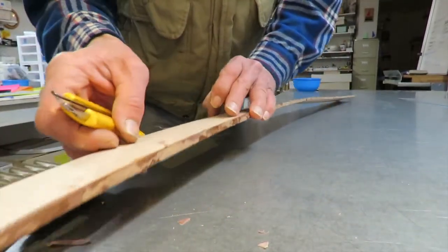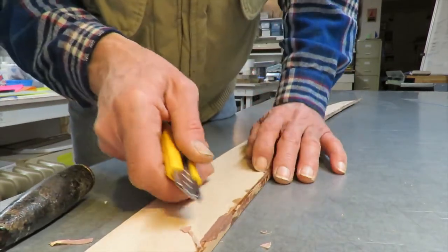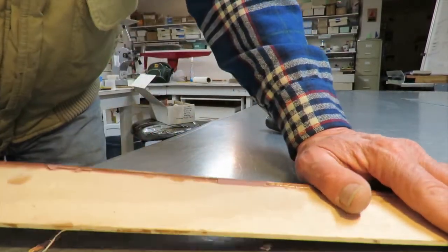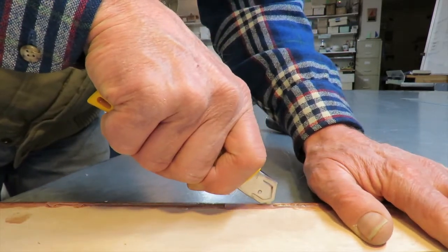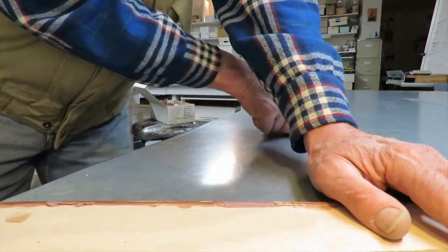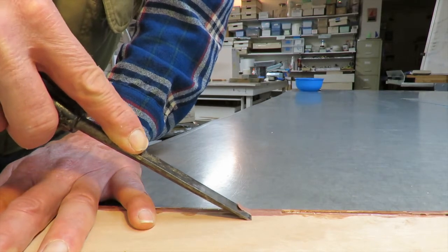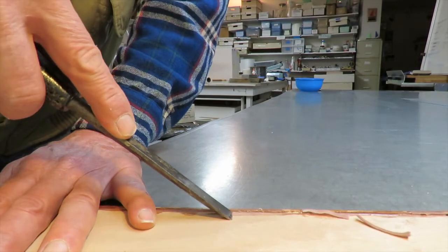Here's a real classic one. Cut right along the edge of the wood, trying to cut just down to the plywood but not deeper. Now moving my hand because it's right in the way of the chisel - hold it back here. These things seem obvious; it took me years to learn that every time I thought I'd be careful and not cut myself, I would cut myself if I held it in such a way that I was cutting towards my hand. See how nicely that comes off - this is just perfect, still cutting easily.